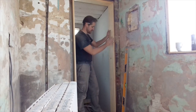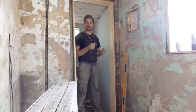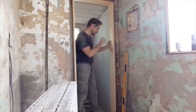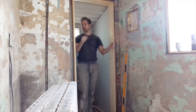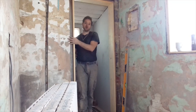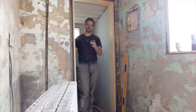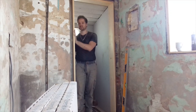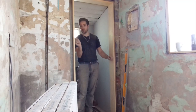So what I'm going to do now is fix this in place, get my door, and put a couple of hinges on it. I'm not going to bother sinking them in because of that little bit of extra depth. What I mean by that is if I start sinking my hinges in, then sink the hinges on the actual door, and then do the test to get this bit level, it'll probably be a perfect fit — but that's not really what you want the first time around, because it just won't work practically that way.